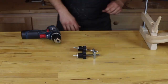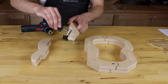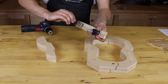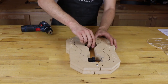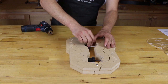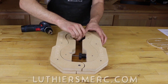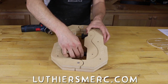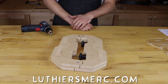And now we're ready for our final assembly. We've got our spreaders — a left and a right — so we can put our hardware into the spreaders and put it into our mold. And by turning the knobs, we can bear our spreaders against the bodies of the mold. And that's the final assembly — that's the assembly of our soprano ukulele mold.